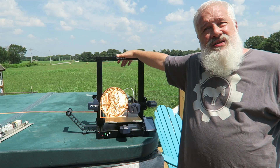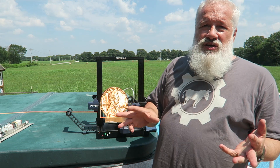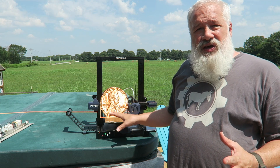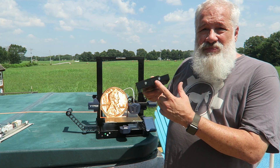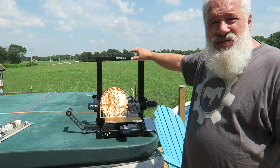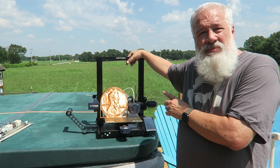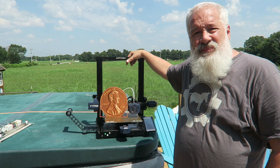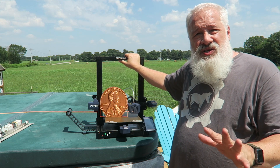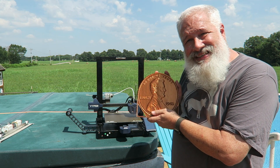Final thoughts on the Anycubic Viper on this 90-plus degree day: I really like this machine. I have thrown PLA, PETG, and TPU at it for literally hundreds of hours and haven't had any issues whatsoever. To be completely honest, there are some things I'd fix: make sure the magnets work on the parts tray, and I'd like a different hotend rather than the PTFE-lined one. I'll probably swap in some Capricorn tubing to help with heat. But other than that, I haven't had any issues with bed leveling or the machine overall — it just works. Does the Anycubic Viper make sense? I'll let you be the judge.